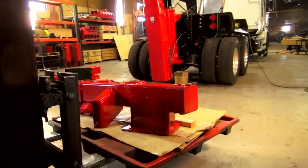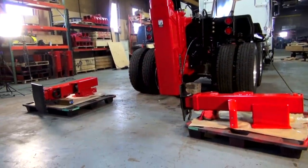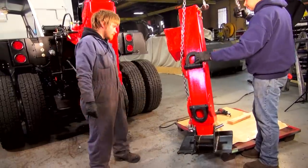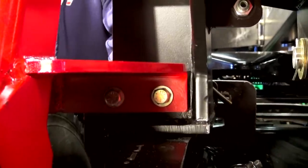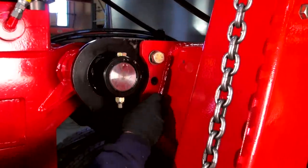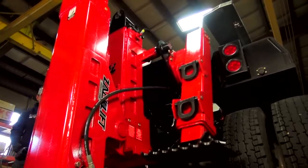An additional feature you can add to your ZAK-Lift are stiff legs — we have 25,000-pound and 38,000-pound stiff legs; these are the 38,000-pound stiff legs. When positioning them, make sure they're in a neutral position so the bolts line up easier. You'll connect the lower two bolts on the back of the stiff legs to your RTU beam, then secure the top of your stiff legs to the RTU beam — there are three bolts on the front and four in the back. You'll only be hand-tightening up to this point, to make sure you can line all your bolt holes up.